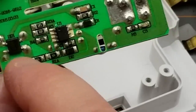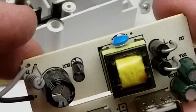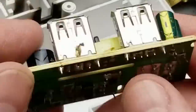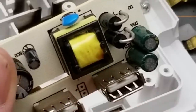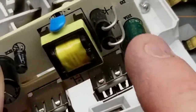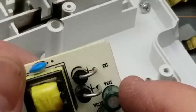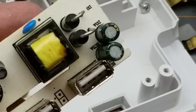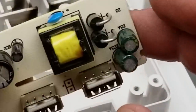Bridge rectifier creating rectified 120-volt AC — about 150 volts DC — with a 400-volt capacitor across that to smooth it, a smaller capacitor as well, and a series resistor possibly acting as a fuse to limit inrush current. The controller chops that into high-frequency AC, bangs it through the transformer, steps it down, and there are two diodes on the secondary — rectifying both sides, which is better than most — plus a couple of smoothing capacitors out to the USB ports. Nothing really shocking as a power supply, and actually better than some I've torn apart.